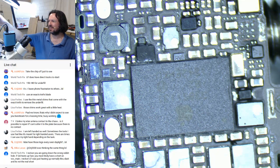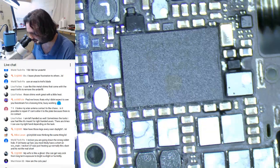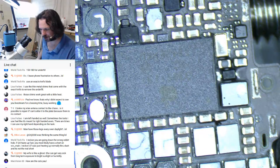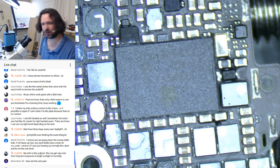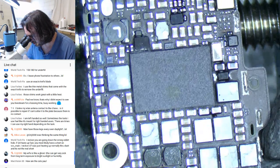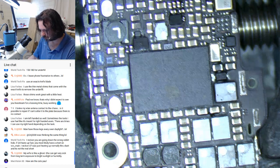This is some sort of sick perversion people have of leading other people down other paths. I mean, you could be right, because the other day Jessa had a stream on exactly that, whereby the PMIC did pop up as a hotspot. But it ended up being a TriStar fault. I can't remember. Yeah, we could always pull the TriStar. But it was nice the way she did it, because she localized what ball it was, or roughly, and then worked out from that.